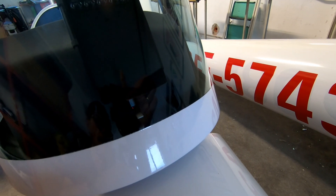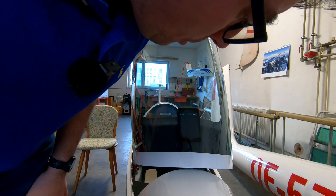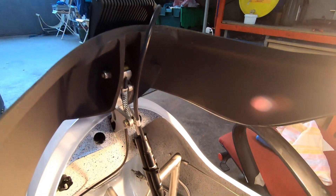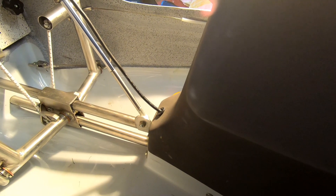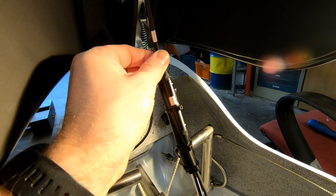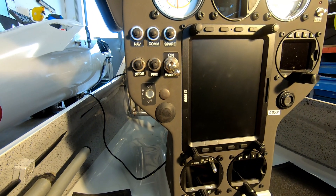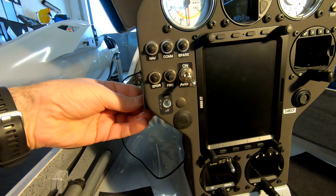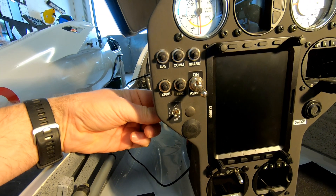And I still have enough room for the locking mechanism of the canopy — wasn't too bad. The cable of the strobe light is now running through the gas damper to the instrument panel where I do the electrical wiring. With the quick release mount there is no problem in case of canopy jettison. That hole here fits perfectly for the switch, which is already combined with the fuse. So I only have to mount it here and do the wiring with the power supply.